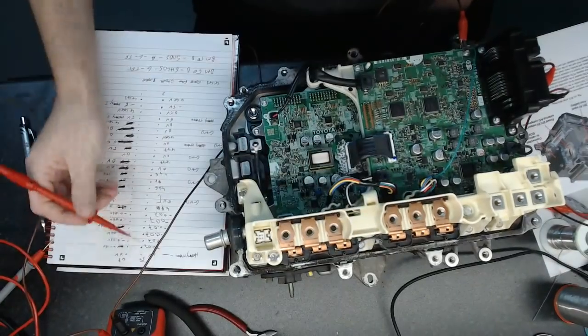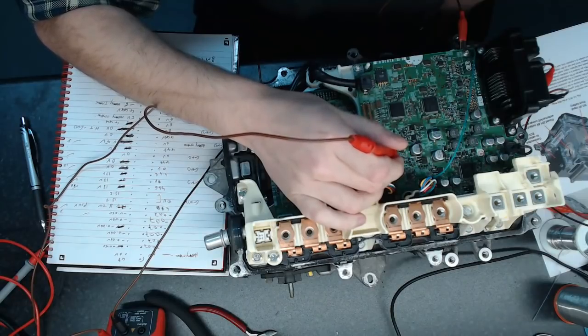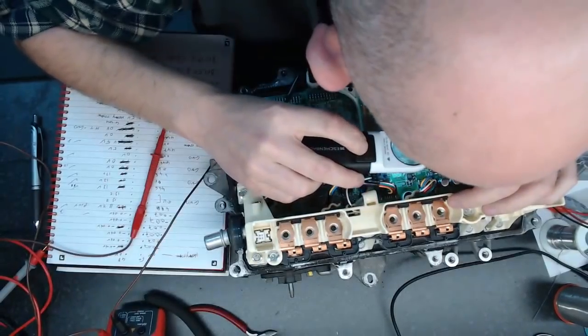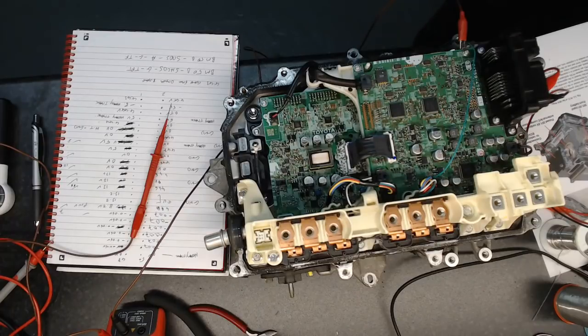So I've got a transistor switch connecting pin 50 to 5 volts, and that transistor switch is currently turned off. But I bet we can turn it on. Or, am I seeing? Hang on. What's KN? What is KN? We have to look that code up. It's definitely KN. Alright, let's go have a look. KN. Right, some weird website. It's not really what I want. KN can be a whole load of very interesting things, but it's most likely, according to this, BST84.